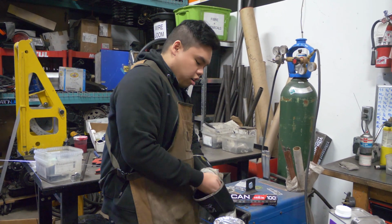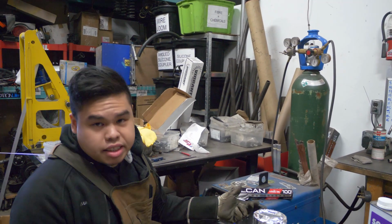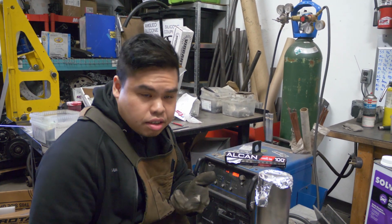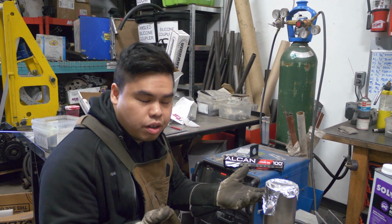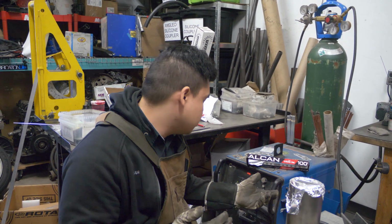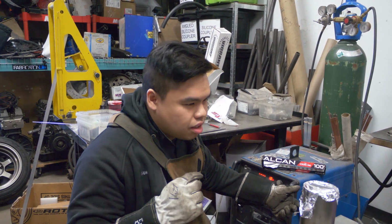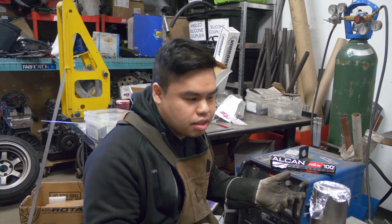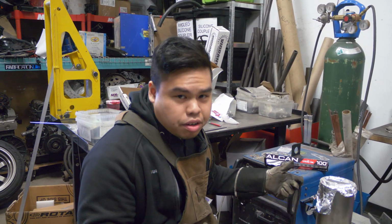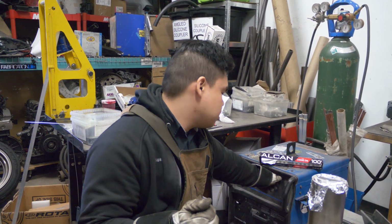And then we're also, make sure we're welding on DC negative. DC negative is for steel, titanium. Essentially, the process of welding titanium is very similar to stainless steel or any kind of steel. It's just a little bit finicky. It's thin, so you gotta be careful with your amperages, but essentially the same rules apply, about 1 amp per 1/1000 of an inch. And so typically, I would run this right now just to tack it.